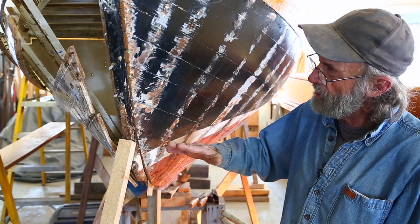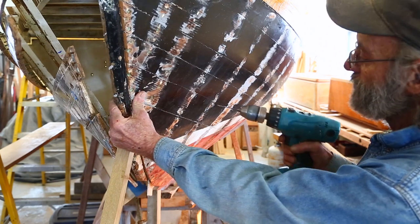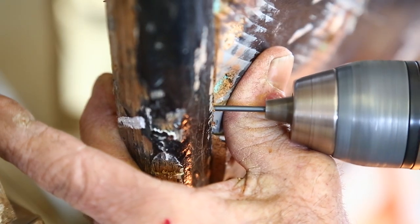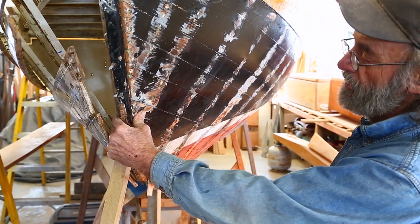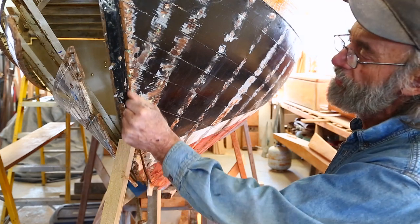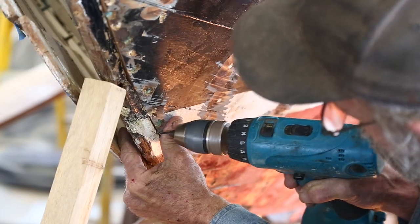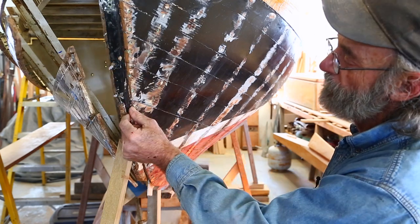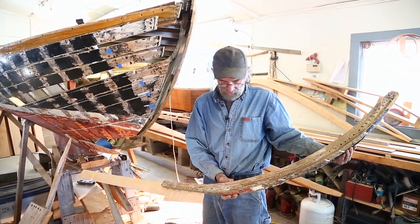To make the new stem pattern, I've come up forward and fit all that planking into position. I'm going to take a little drill and drill a hole right across from the rabbet line on to the other side, then pull it back out, and I'm going to do that all the way down. The reason is I'm going to lay this side of the pattern down on the table and I want to mark that line onto the table. I can't get underneath to do it, so what I've done is drill holes across. Once I lay it down on the table I can insert the drill into the hole from the other side and drill onto the table — that's going to transfer the rabbet line from this side onto the table. This is the pattern we'll use to set the brackets on the table.